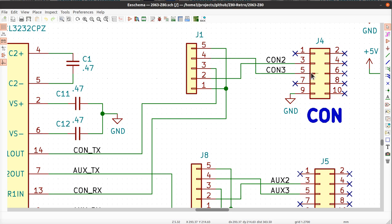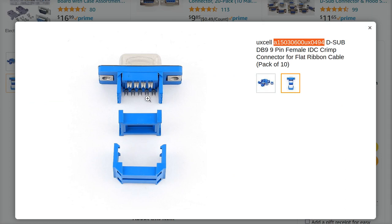Now, on a D connector, what you've got, this wire that comes off this connector here goes to D-sub pin 1, this goes to D-sub pin 2, and D-sub pin 3, all right? In spite of how they're numbered here, the physical ordering was obviously designed to match this kind of an arrangement here, right? As I've been ranting for 15 minutes.